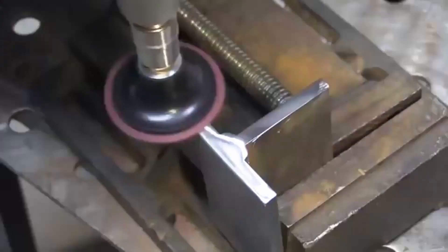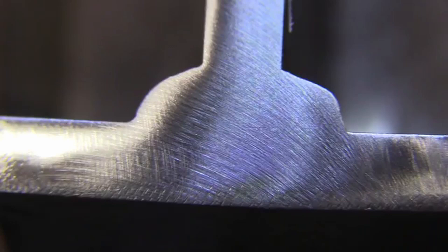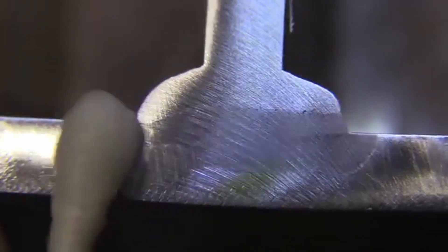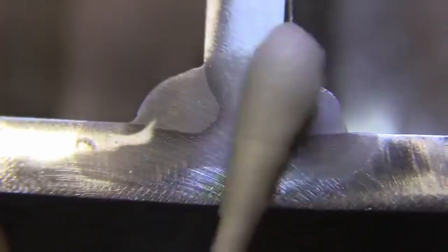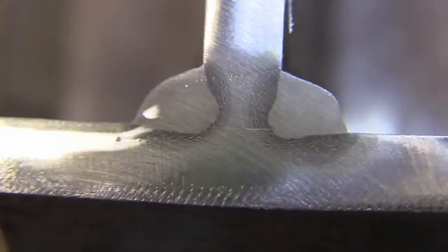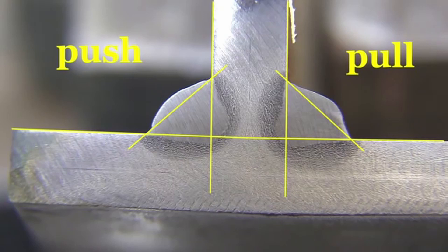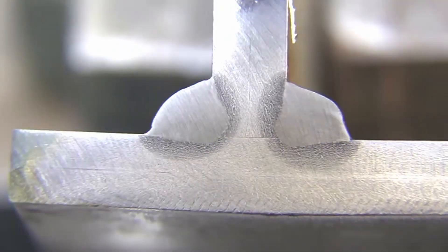One cut and etch in the middle here. I polished it with a brown Scotch-Brite followed by a red Scotch-Brite Roloc disc, and then I used a little bit of etch — basically a passivation solution for stainless steel, but that just happens to be what I have on hand. You can see right there there's some slight minor differences, but not night and day. We'll do a little hash mark so you can see exactly where the penetration is and where the weld nugget is. Both of them got in there; there are minor differences.